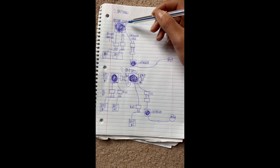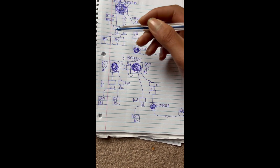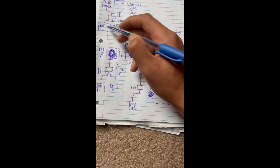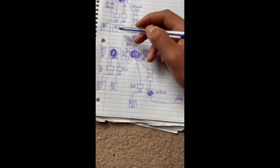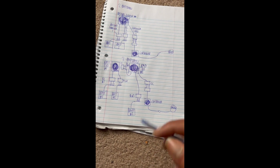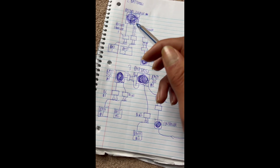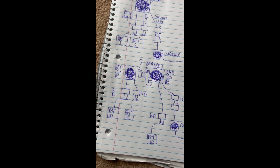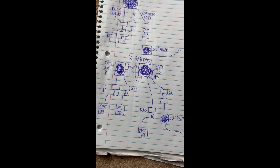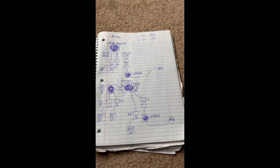Let me explain how this works. With just two batteries, we have a battery isolator with battery connector one, battery connector two, and a cable for the controller. The first battery connects to the first port, the second battery to the second port, and the controller cable goes to the controller and then to the motor. It draws power from both batteries simultaneously and keeps their charge level about the same. If battery one is at 54 volts and battery two is at 50 volts, it'll drain battery one down to 50 volts and then start draining from both at the same time.